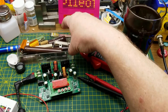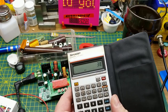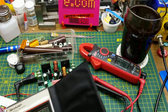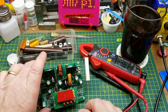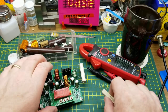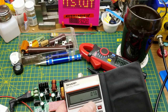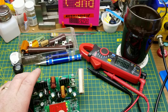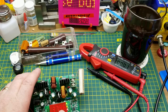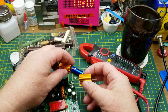Now I want to check the current as well, so I'll grab some big resistors. There's 100 ohms — 38 volts over 100 ohms is going to be about 380 milliamps. There we go, that's pretty much exactly what we calculated. I do have another 100-ohm resistor, so let's put that in parallel — should be 760 milliamps. 764 milliamps — that's reasonable enough. And it's still holding its voltage at 38 volts. Good.